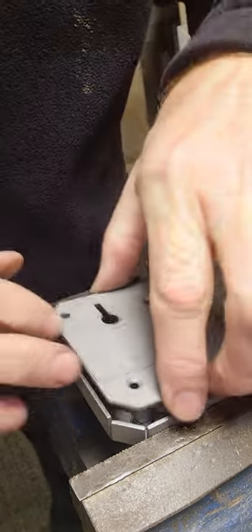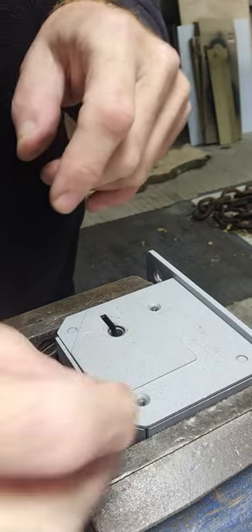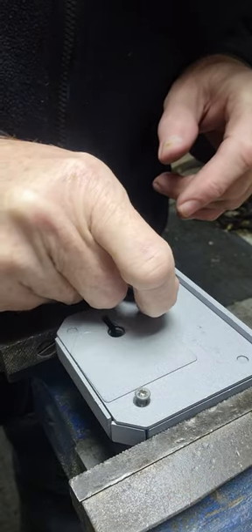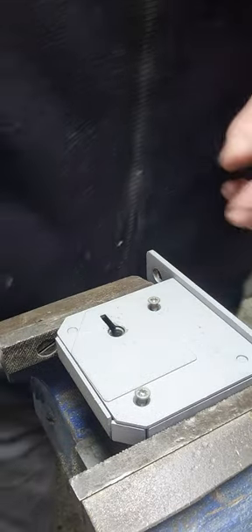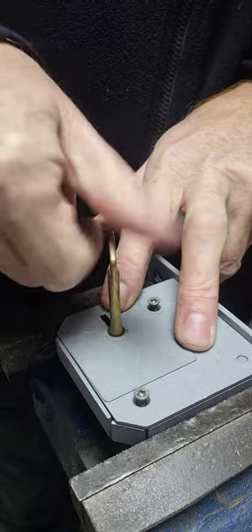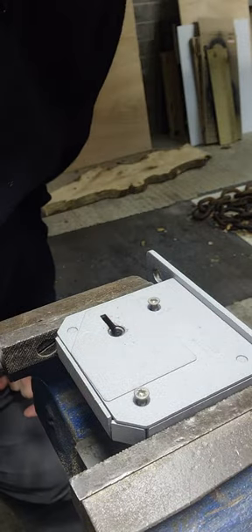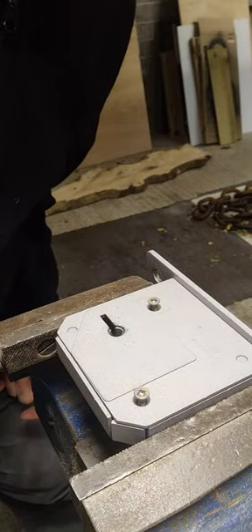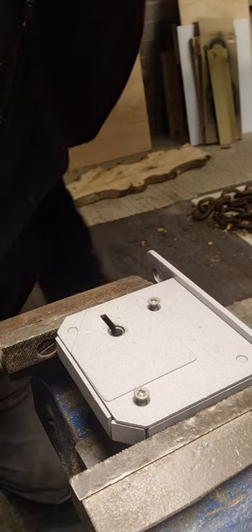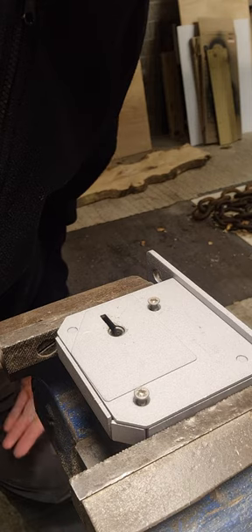This lock is from 1987 I think it says on the case. Sometimes it's hard to get the wheel back in, but it's gone in easy. Do the screws back up, nice and tight — and that feels tons better already. So much better. And that's it — that's how you change a curtain or a wheel in a Chubb 3G 114, now made by Union. They call them 3G 114s. A slightly bigger bolt comes out of the newer ones, but that's the basics on all locks of this sort.